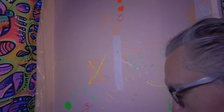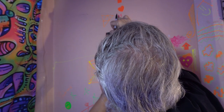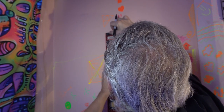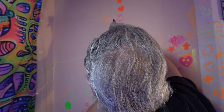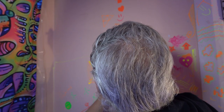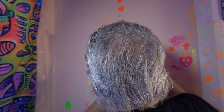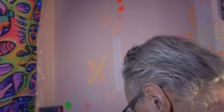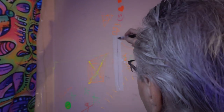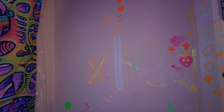Now, because this is a vertical mount, it makes it a little easier. I want to be able to try and get a plumb line. So we're using this part of the level, which just shows us a nice up and down plumb line. There are other ways that you can do this that can work just as well too. You can do a drop line where you put in the first hole and then just hang a rope with a weight on it. I just dropped the tape. Hang a rope with a weight on it and let it stabilize, and that will give you a straight up and down plumb line as well. I happen to have this, so all good to go.